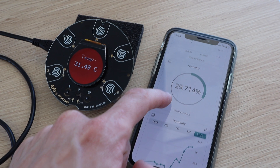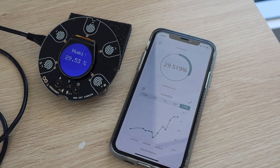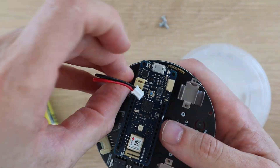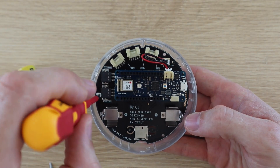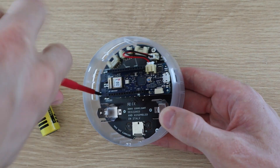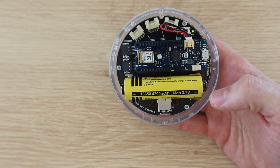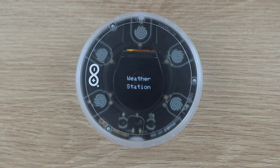You can now watch the display and the app update simultaneously. The last thing I'm going to try is putting the weather station into the case and powering it using an 18650 lithium-ion battery. For that we need to add this little power lead between the board and the Arduino. We can then screw the carrier into the case to hold it up against the faceplate. Now let's add the battery to power it on and close the back cover. One thing I would have liked to have on the carrier is a power switch — as soon as you put the battery into the carrier the Arduino turns on and you can't turn it off again without removing the back cover and removing the battery.